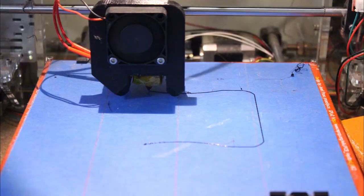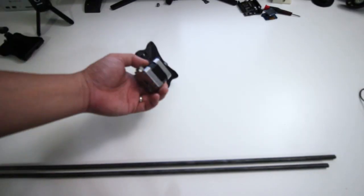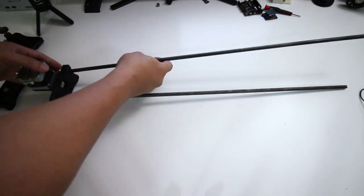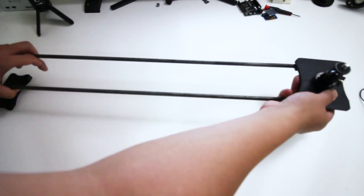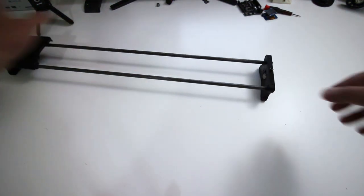Now that we have all the parts, we just need to assemble everything. The frame is designed using CAD software, and then I used my 3D printer to print out the parts. I'll leave all of that on Thingiverse — link in the description below. The rails I got from Lowe's. First I installed the stepper motor to the frame, then added the rails, installed the dolly with the bearings, and closed the other end, leaving a little leeway for tension.